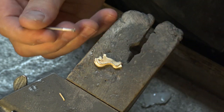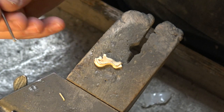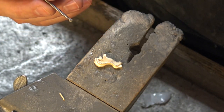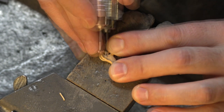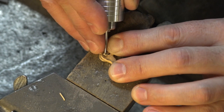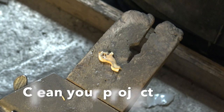We want this nice and smooth. Just to let you know, you can use this technique to fuse any piece of gold together, as long as you have two surfaces that are relatively smooth — then you can fuse them together. That looks pretty good, so I'm going to clean this in an ultrasonic and hit it with the steamer, and we'll come back and actually fuse the piece in.